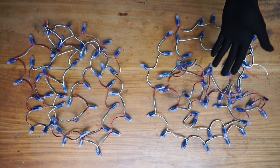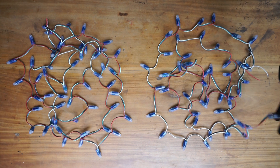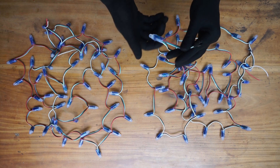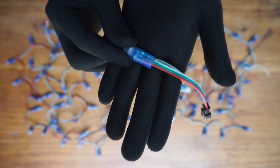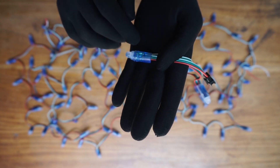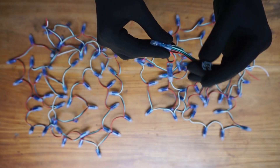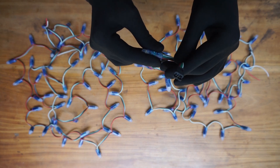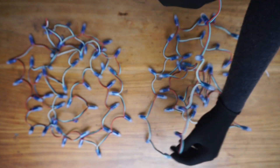The first thing you have to do is to identify the first and the last pixel LED of this string. Take any of the pixel LEDs at the end of the pixel LED string and look inside where you can see an arrow pointed towards the wires. If that arrow is pointed towards the connector — this is a SM3B connector — then this is the last pixel LED of this pixel LED string.